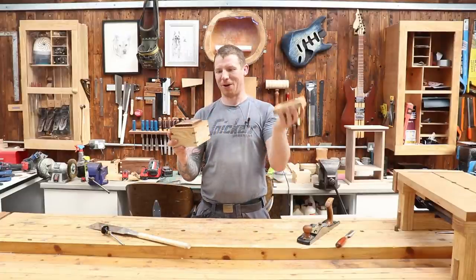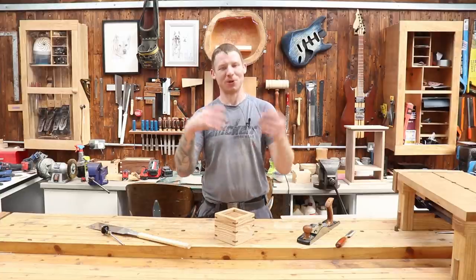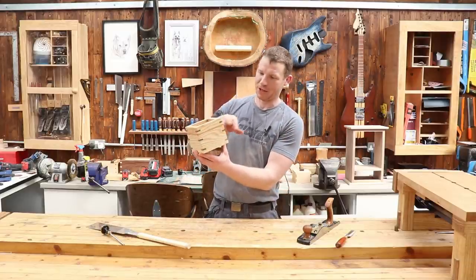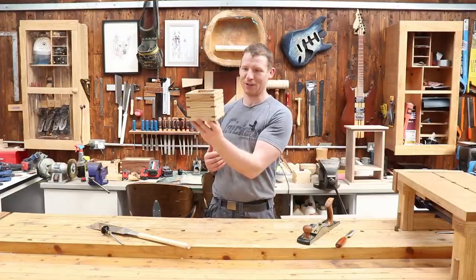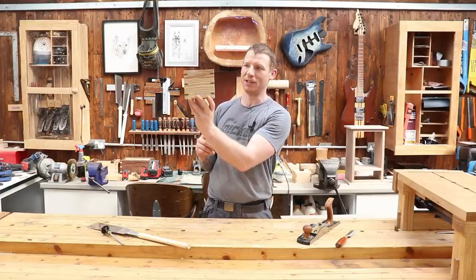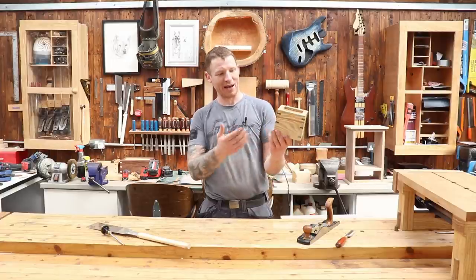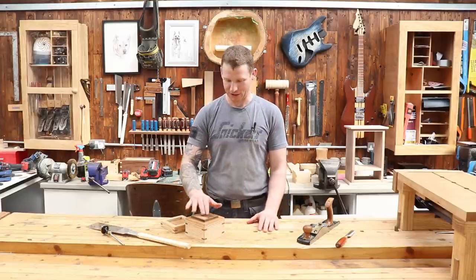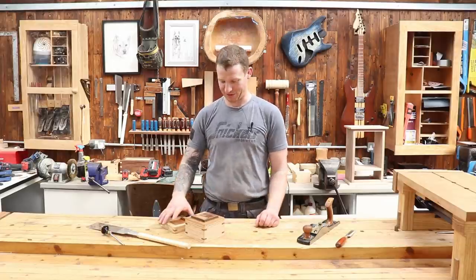One puzzle box complete! I really enjoyed that build — it's a gift for somebody, and when you have somebody in mind it always inspires you a little bit more. It's made from ash, we have our walnut mitre splines, and that cherry line between the lid and the body of the box turned out quite nice. We made a mistake but we recovered, and actually it's a nice little touch. Maybe in future I'll do a line of different material — a red, green, or blue acrylic in there would be lovely. I always design on the fly, never have a plan, and by accident we discovered a nice little detail. Leave your internal box about two millimeters oversized so those pieces can rattle a small bit — otherwise you'll never get them out.